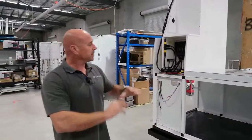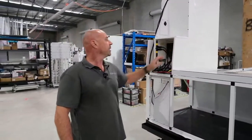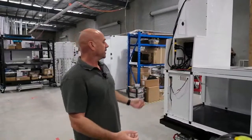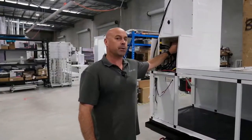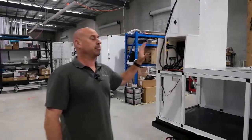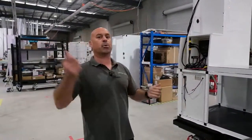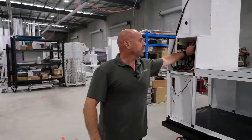Some multi-cables go into joints that go into these, what we call a CZone Contact 6 hub. And what it does is it allows us to make the whole bedroom area, everything works in this bedroom, the lights, the switching for the 12 volt in the tunnel boots and things like that, come from the one area. And if there's a fault in any way, we can trace that really easily. Not only that, we can actually tell an end user how to fix a fault, easily identify where it's coming from. Instead of trying to trace it through a wire through the whole van, we can take it to one spot. So we've broken it up into these Contact 6 units.